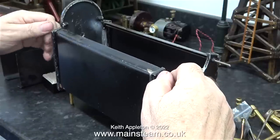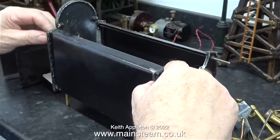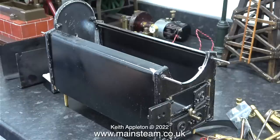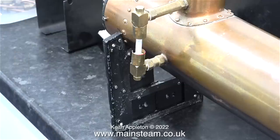The boiler is assembled in a very similar manner to a Stuart 500 and 501 boiler. I don't know why this studding is so long though. But for the moment, I'm assembling the boiler just to see how it's put together, and I'm pleased to say that the design is good. The rotary latch on the end is just slightly too big, so it's quite fiddly to open the doors. The water gauge for this boiler sticks out of the side like this — I don't know what the brass shrouds are in aid of, so I'm going to remove those and the gauge glass too.